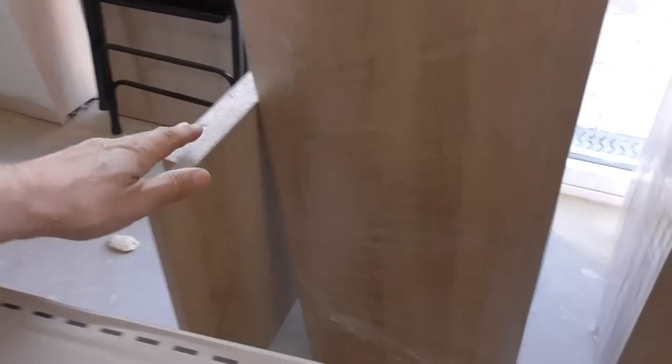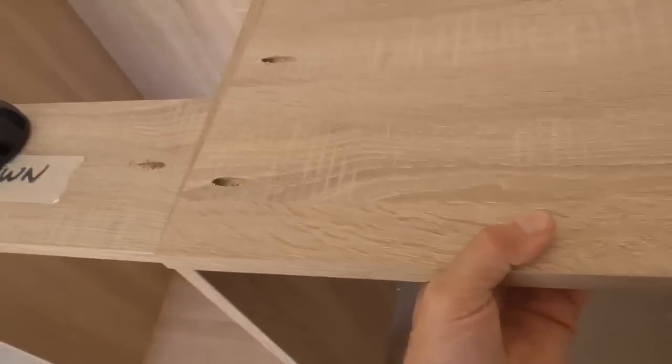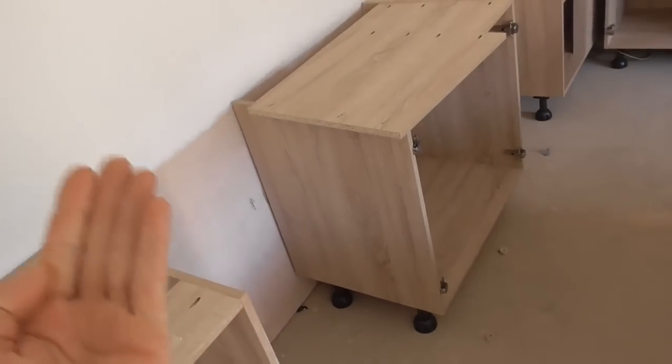What this kitchen designer and company do is give me what they call appliance spaces. So you can see the space for an integrated washing machine here and an integrated dishwasher there. They actually give me these, here they are, look. They're quite good. All these shelves, yeah. They're basically shelves, but they're 602mm wide. So although the cavity should be 600, we put them at 602, which just gives us a little bit of extra space. And as you can see here, they're pocket screwed on the underside. So basically we can just put them in like this and pocket screw them together, and it keeps those two cavities nicely spaced, but also nice and rigid in a straight line. Obviously I'll put the pocket screws up underneath, and then the guys can do the templating, and when it's all done, you can just unscrew them and drop them out.